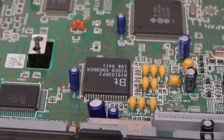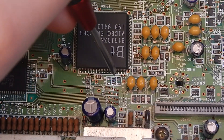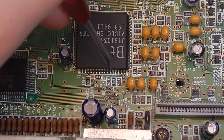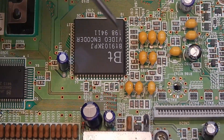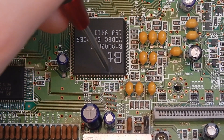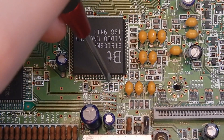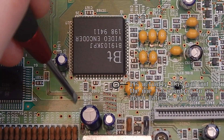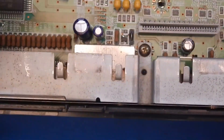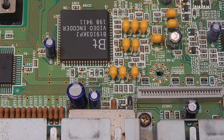Now we are going to put a switch in, probably mounted on the back of the console somewhere, so that we can vary between 5 volts and ground running to this pin. When this chip is in 240p progressive mode, the system can actually run a bit faster, and a few games wind up broken because of that — the likes of Another World is one of those games that just runs far too quick. So we will take 5 volts off this pad here, take ground off this via here, run them up to a switch at the back, and then we can switch this pin between ground and 5 volts.